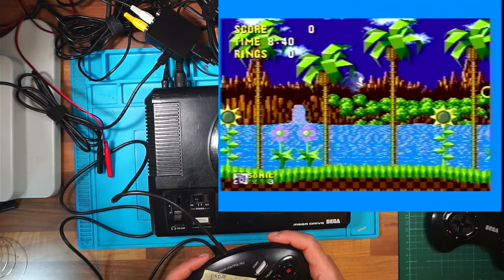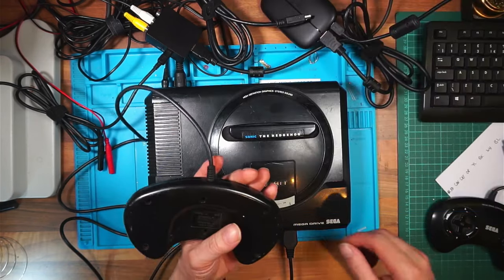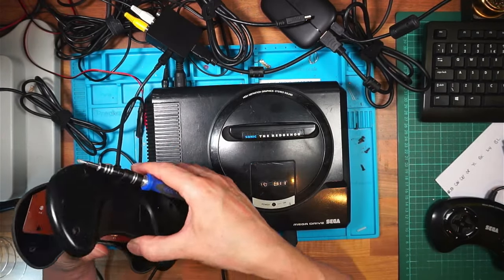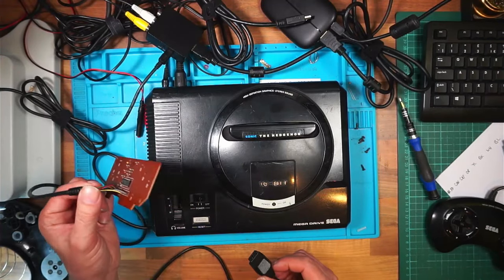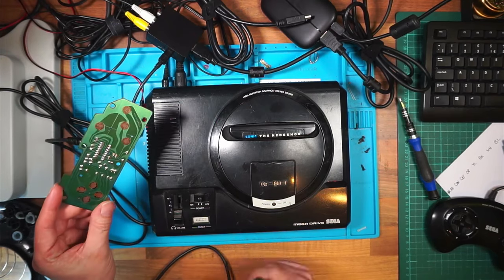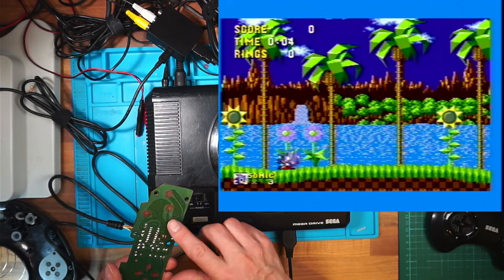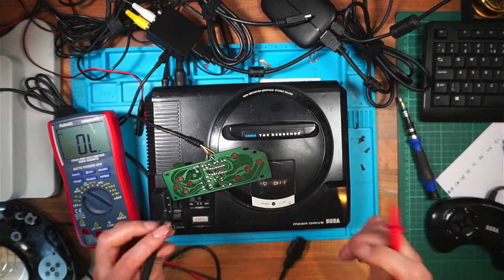Switching off and opening it up to find out what I've done wrong - I'm hoping it's just a solder bridge. The solder joints look okay to me, and the colours should be correct since these were bought for the Sega controller. Plugging it back in with the case open so I can confirm no buttons are being pressed - and Sonic is still going crazy. So it's got nothing to do with the pads - there's something wrong with this cable. Checking for shorts.